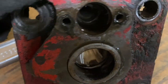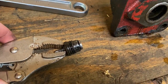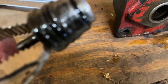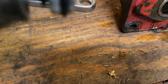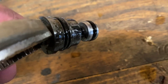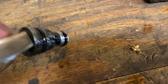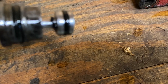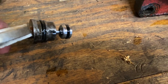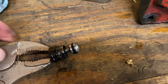Let's get a better light to try and see in there to show you guys what the inside of that bore looks like. I don't know if you can pick this up on camera or not, but the o-ring that's in this detent or in this plunger — either it wasn't the right size, or it kind of sticks out that side a little bit. I did replace that one early this year because it was leaking quite a bit worse. That was the only one I could find without going and getting parts and I was kind of short on time, just to get the leak slowed down. As you can see, there's also another small o-ring — I did not replace that one, but it's pretty flat. It doesn't look good.